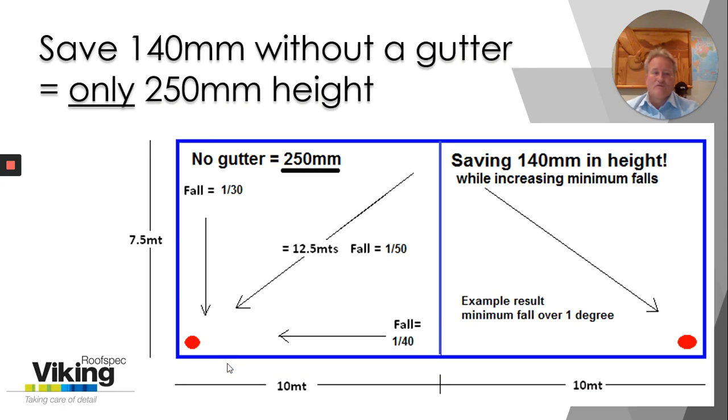Here's another example of the same roof dimension falling as I proposed. We're level here and we're level here. The roof fall is two degrees all the way to the outlet over the 7.5 metres. Two degrees is a 1 in 30 ratio, so 7.5 metres divided by 30 equals 250 millimetres — that's our fall at that point. These other dimensions' ratios will work off that 250 millimetres. You take the length of that dimension divided by 250 millimetres to give you your ratio. If that length were 15 metres then that ratio would likely drop to 1 in 60. The one to watch is this longest fall — this is not a valley, this is just an indication of the longest area of fall — and I would never want that to drop below 1 in 100. In doing this you're actually showing compliance with E2: you have constant watershed, none of your falls drop below 1 in 100 which an internal gutter does, and you've got your two degrees fall.